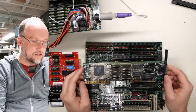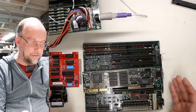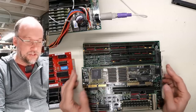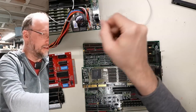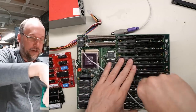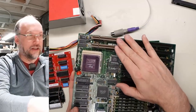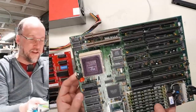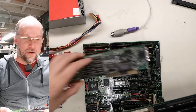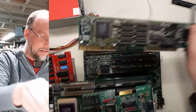When I got this motherboard, a Trident video card was plugged into it—I tested it and it works. We can use it to check performance compared to this other motherboard I have here, which is a 486—I think a DX2/66. It also has local bus slots and is obviously a lot faster. I have an ISA Trident card and we can compare that to the local bus one.